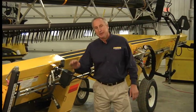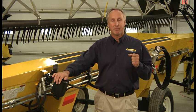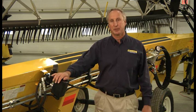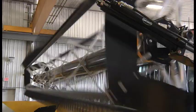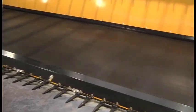One of the first upgrades I want to talk about is the hydraulic system. We have upgraded the hydraulic system to reduce the operating pressure up to 50%, leaving more available power for those tough crop conditions. What we did is we re-plumbed the system, putting the reel in after the knife drive. That allows the reel to have more speed for certain crop conditions. We also put the drapers on their own circuit, and that eliminates any chance of surging. All of this is going to help you perform better in those tough crop conditions.